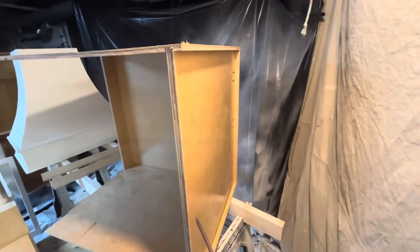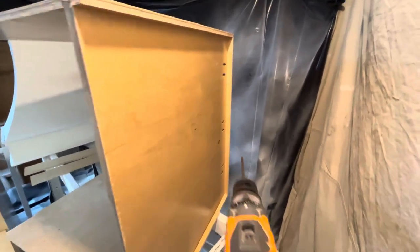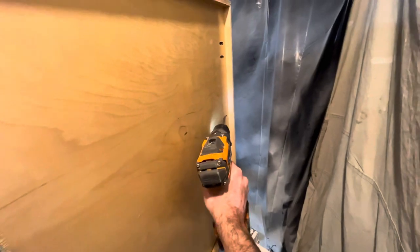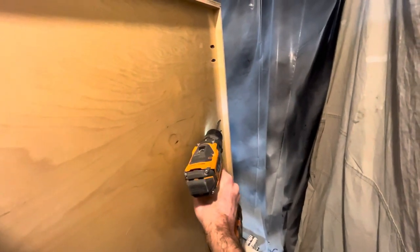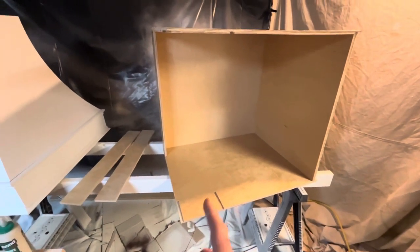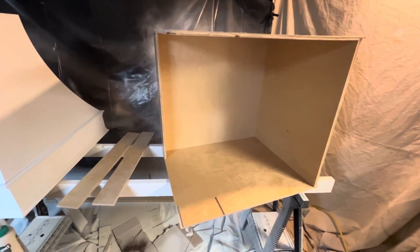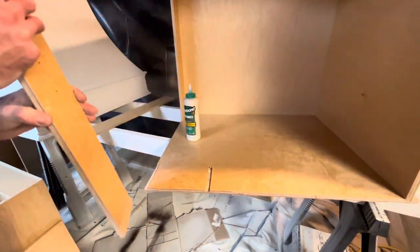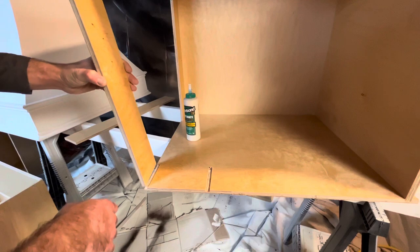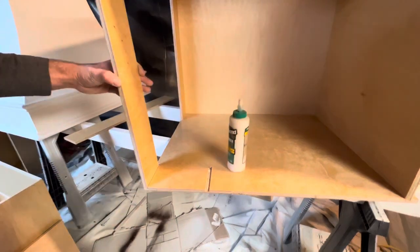With the two sides on, we know that the bottom piece is square, so we can go through and attach all the Kreg screws. Now all that's left is to attach the front two stretchers — the top one is for support and to attach the countertop, and the middle one is for the drawer and attaching the face. I've applied glue here so I'm just going to nail these in. If there are any scuffs I put those on the side that won't be seen. I'm gluing the top as well.